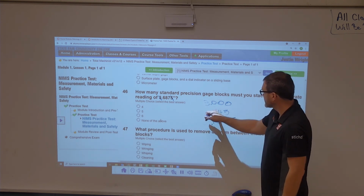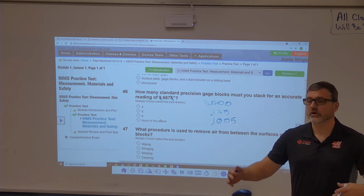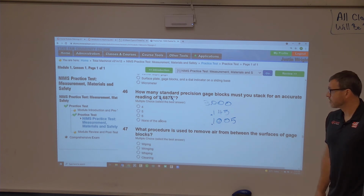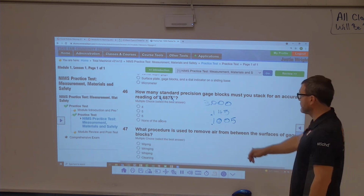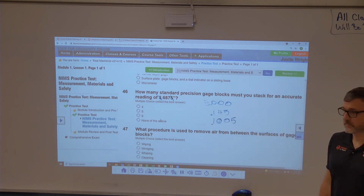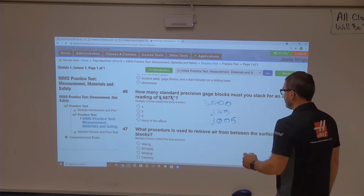So at this point, we have 3 inches, 245 thousandths and 5/10. This is just adding, is all it is, but the only problem with the adding is you have to work within a set of numbers. You gotta get a 7 somewhere. I was thinking we add a 143 to it. A 143 with this one? Yes, and then we add another 300 thousandths and we'll be there.